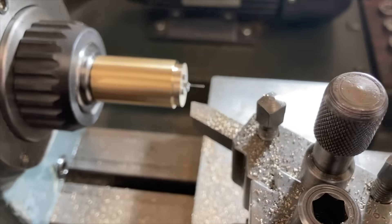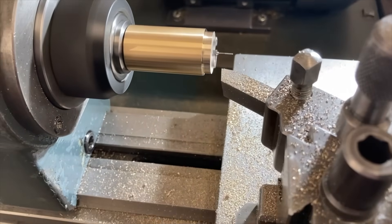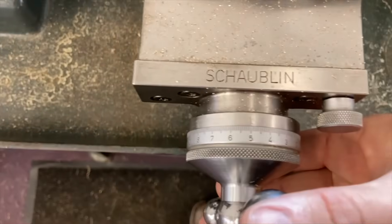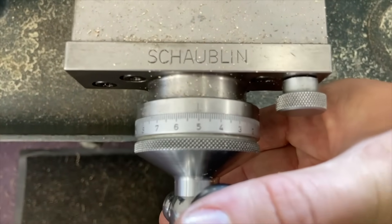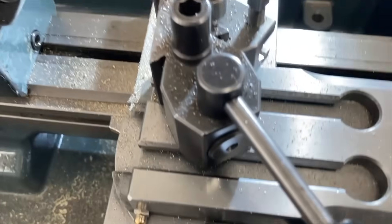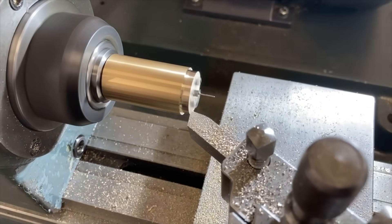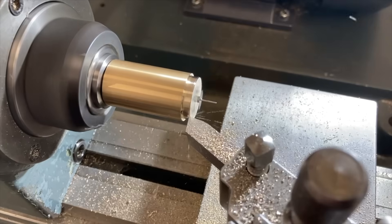The first thing I had to do was to machine down the OD of the wheel so that I am effectively machining away the damaged teeth, but not so far that I was going to break through the crossings — leaving enough material of the original wheel to fit a ring gear to.